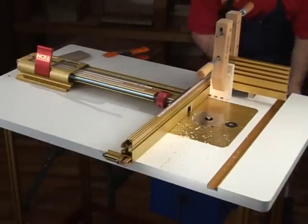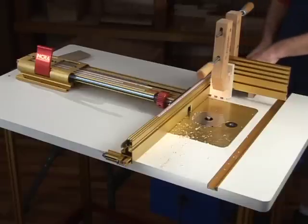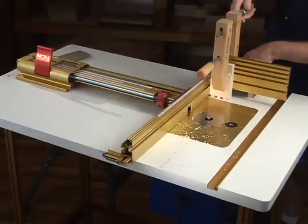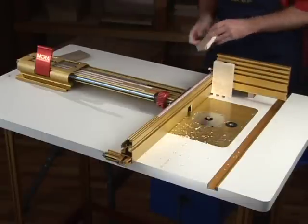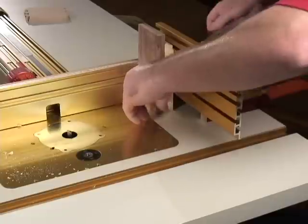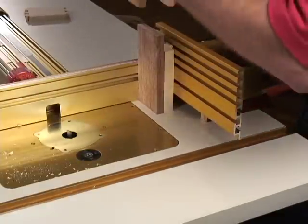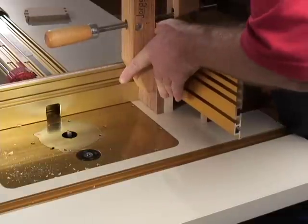After completing the tail cuts, return the right angle fixture to the end of the fence and clamp in place. Remove the tails, flip the backing board over, and add the two pin boards. Tighten the hand screw clamp, then remove the spring clamp.